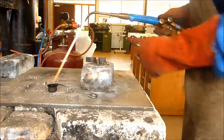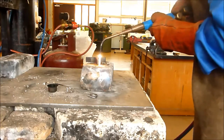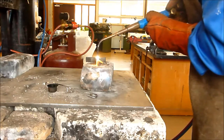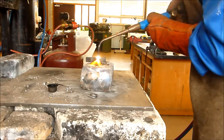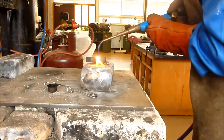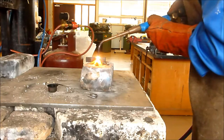So we tacked the metal together and we're going to repeat that over here. Remember: the cone pointing right to the middle of your weld, drop it back 20 degrees, and about a cone's distance away from your work piece — maybe just a fraction more. Hold it steady. This could take a little bit of time — maybe 10 to 15 seconds for the steel to become molten.